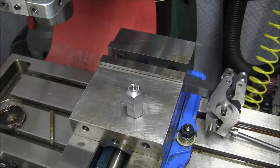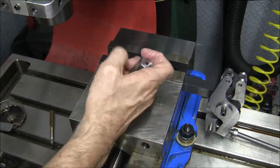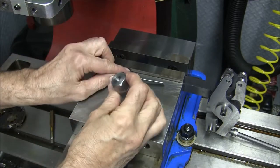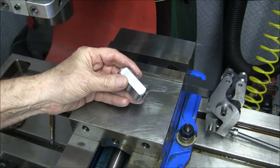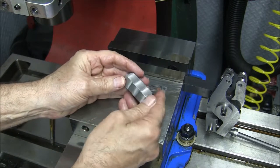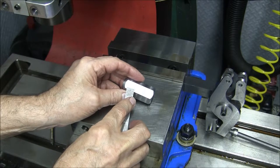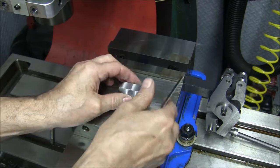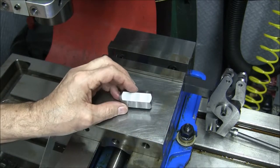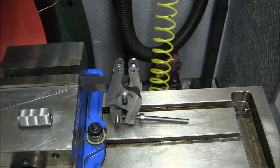There's a nut. It's finished - just tapped, chamfered, two inches long. Gives me something to put my hand around. The surface is blended really well with my homemade DRO on my mill. Happy with it. We need to see if it's going to fit on the screw.